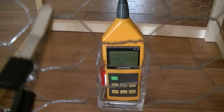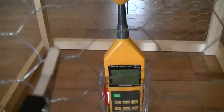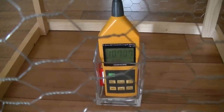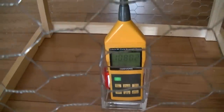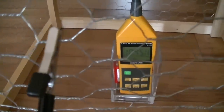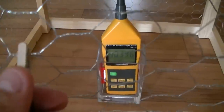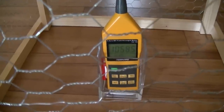I don't see a change. The cage is now grounded and I'm seeing the same figures coming up on that meter. I have to conclude that regarding grounded and ungrounded Faraday cages around 2.4 GHz Wi-Fi, it really doesn't seem to matter if the cage is grounded or ungrounded — you get the same values.